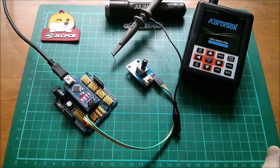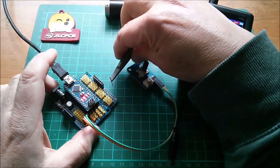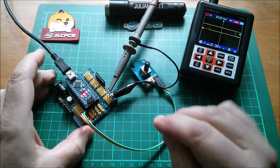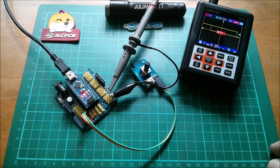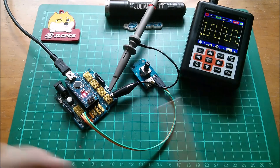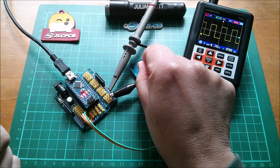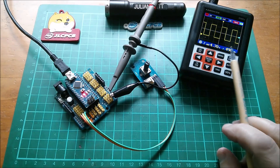Let's switch the scope on. I've got a spike on a pin — a sort of Dupont pin in there. I'll put that in pin 3, and I need ground which I can get by sticking it between those pins so it won't be able to swivel too much and short out on the adjacent VCC. Let's do an auto on there and see what we've got. The PWM is responding to the pot — it goes fully to 100%, fully to 0%, and 50% in the middle — but the problem is 490 hertz, and I want one kilohertz.